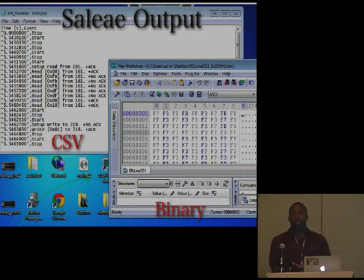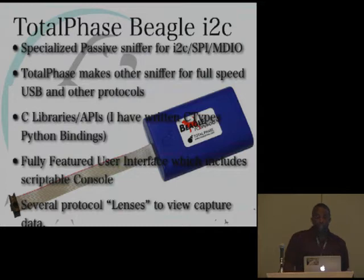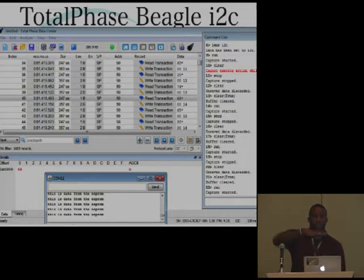For more hardcore bus sniffing, I got something called the Total Phase Beagle. It has a really nice Wireshark-style real-time traffic interface, and when you select an individual packet it gives you the traditional offset hex and ASCII representation. I highly recommend it for I2C, SPI, and all kinds of sniffing. They have a bunch of different models — I got the lower-end one for SPI and I2C, but they also have a full-speed USB 2.0 analyzer where you can use it to sniff USB.